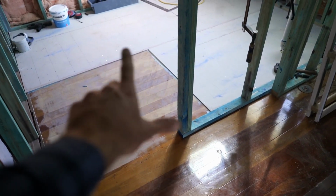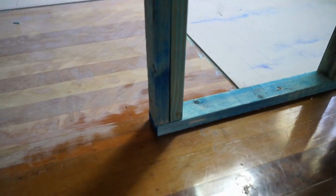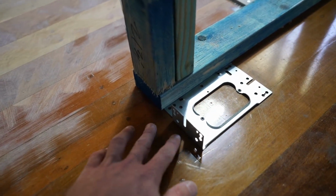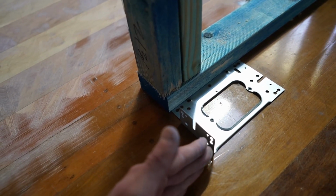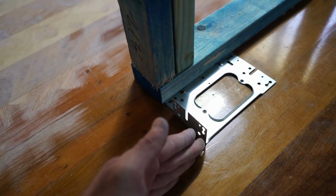So what I'm going to be doing is getting this cement sheet. It's going to come out, and the way that it will be framed for the finishing is the waterproofer is going to put an angle in here all the way across, but I want the slider, if you can imagine it sort of like that, to be sitting on top of the tiles as it slides out, which means I want the angle to start somewhere about there, which means I need my fibre cement sheet to come out to there so the angle can sit on top of it.